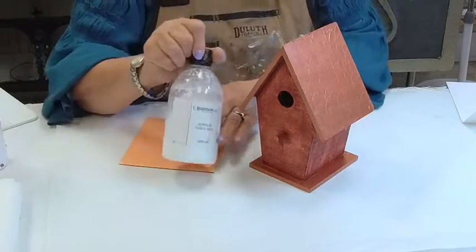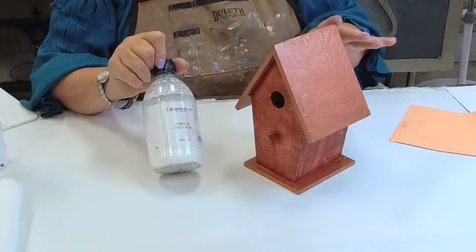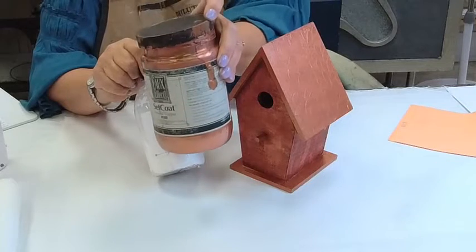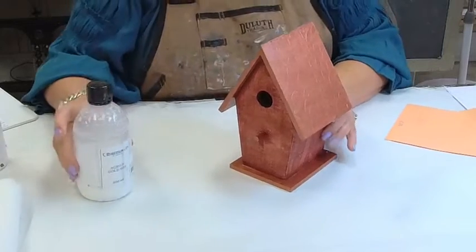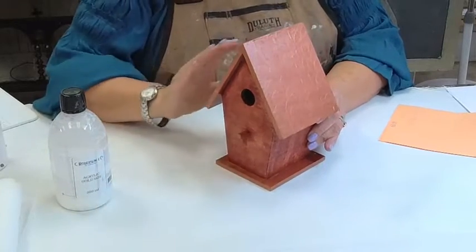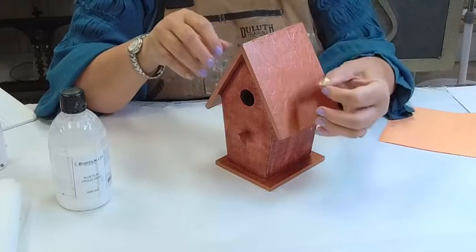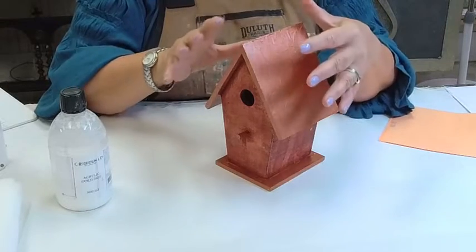We used our Roberson's water-based gold leaf size over every part here that was painted with the copper set coat we applied yesterday. Here's our copper set coat in my very used-up container, and here is my Roberson's. You apply Roberson's with a brush, a sprayer, or a roller — preferably a low-nap velour roller, not a sponge roller. Sponge rollers create bubbles, and when those bubbles pop they create little dimples, leaving spots without foil adhesive — giving you a speckly, weird, textured finish.